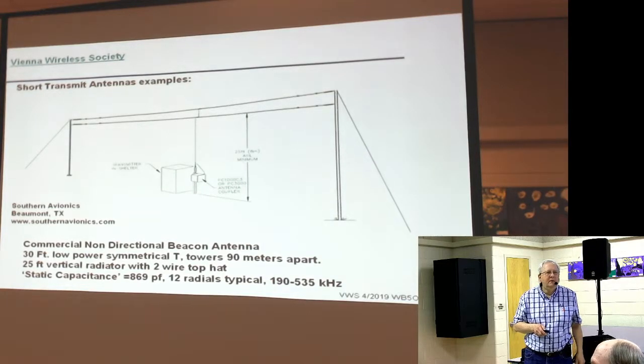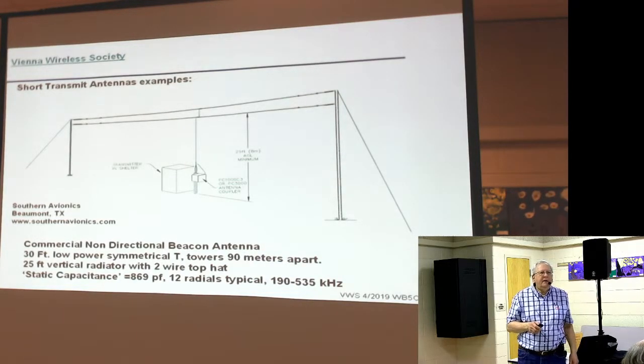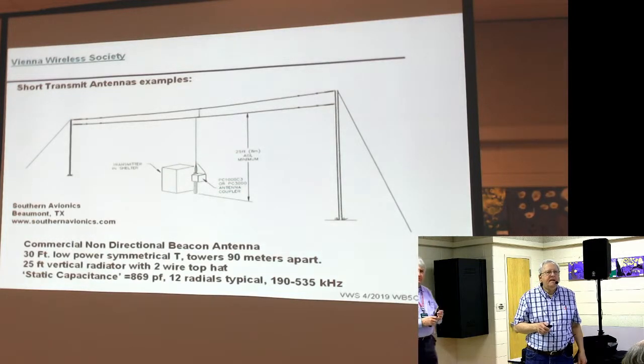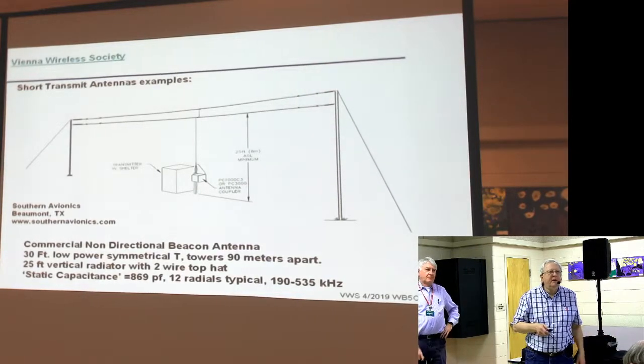Being the second submarine enthusiast in the building here, I've read a lot about it, and they did NVIS. They operated at between 4 and about 6 or 7 megahertz within the Wolfpack, from the Pacific back to Germany when they were out in mid-Atlantic. So those were not LF receive antennas. What they did is exactly what the U.S. and the Russians are doing, a one-way receive only. And I think that's typically loop antennas, probably mounted somewhere on the hull.